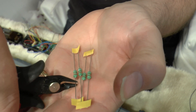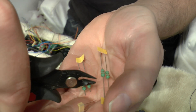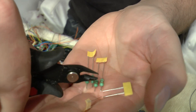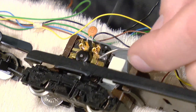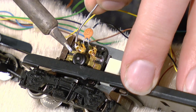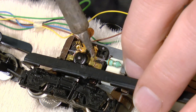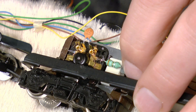Now with the motor parts in place, it's time to add the digital propulsion components, which is the decoder. We kick off the assembly by cutting the leads of the inductor to a proper length. The inductor will then be soldered to the terminals of the motor. First I put some tin on the terminals just to make sure that the soldering goes easy and smooth once I have the components in my hand. I fix the component and make sure that the soldering looks okay.